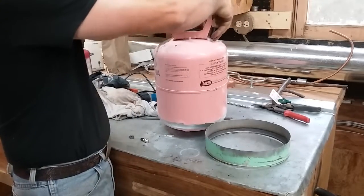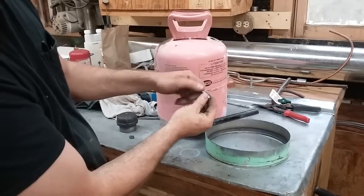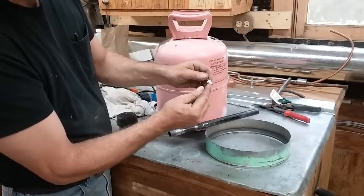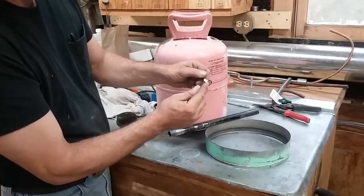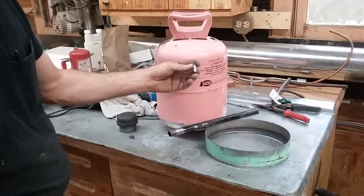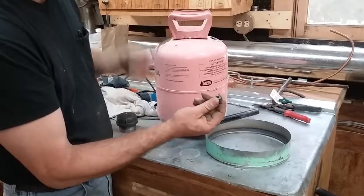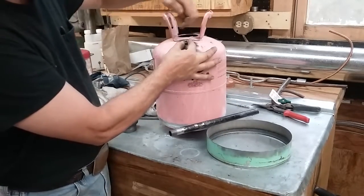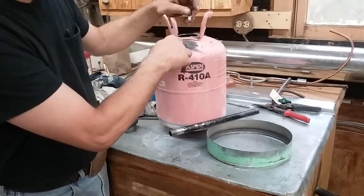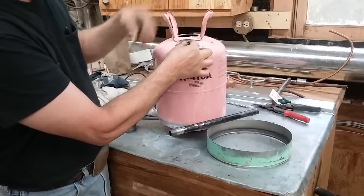The pipe is going to go over here. To air this up, this is called a snifter valve — it's just a bicycle valve with an eighth-inch thread; they make these in eighth and quarter pipe threads. You can get these at real plumbing supply houses. I doubt Home Depot or Lowe's would even know what you're talking about. I'm going to weld this three-eighths nut down and use that for my threadlet, because there's no way I can tap threads into this thin metal and have them hold. So I'm going to weld a threadlet on there and drill and tap it for eighth NPT.